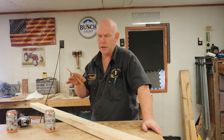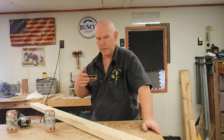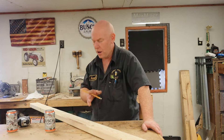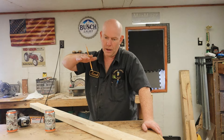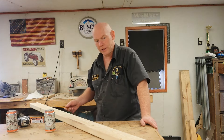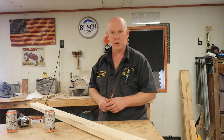The reason I'm cutting to 32 instead of 30 inches is because of snipe. When you use a benchtop face planer, you get a little snipe at the front but it's minimal — it's at the trailing end that the board always kicks a little and you get a groove taken out. So with two extra inches on the end, I can just whack that off down to my 30 inches, cut the snipe off, and end up with a nice seamless stripe.